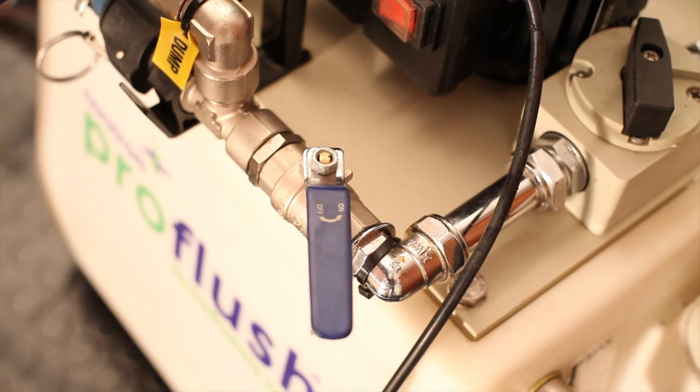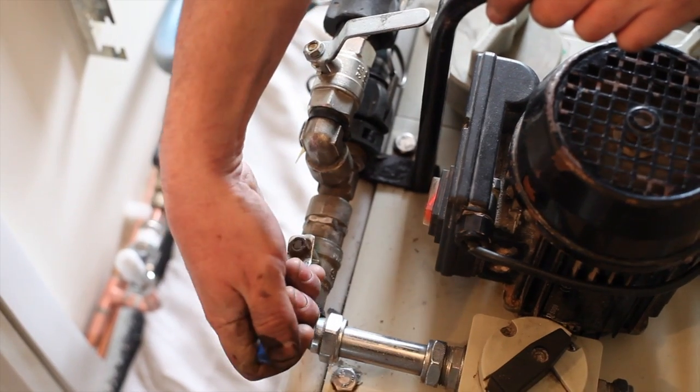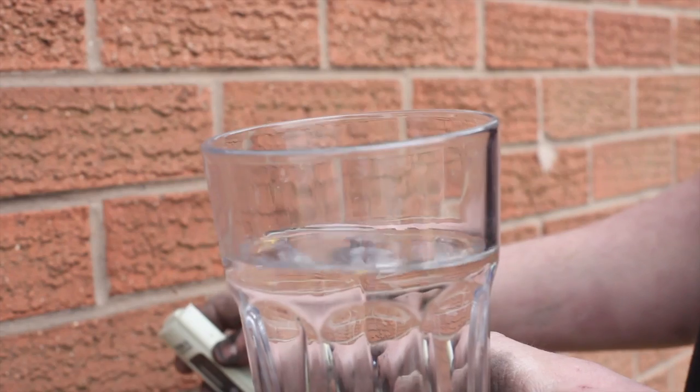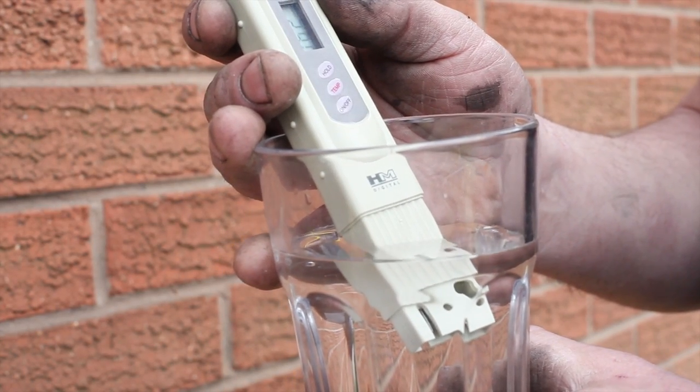When you start to get clear water in the tank, allow the mains water to fill the tank to almost maximum and control the levers to ensure the water in the tank stays at the same level. After a while you will start to get fresh looking water outside at the dump end. If the radiator is particularly bad, you may have to quickly reverse flow like this in order to remove as much of the debris as possible without recontaminating the fresh water in the ProFlush tank. When the first radiator is found to be clear at the dump end, obtain a TDS reading with the meter.